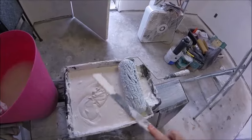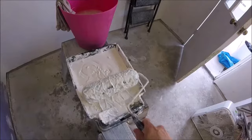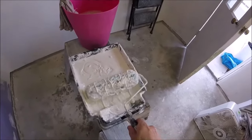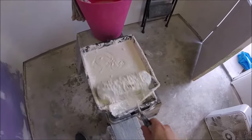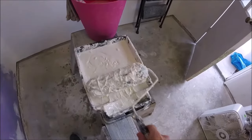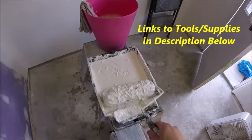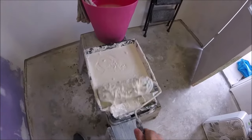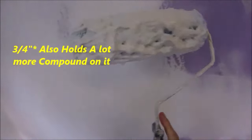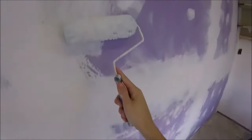I got it to the consistency I want. Now we're just going to take our normal paint roller. This is a three-quarter inch nap roller — you'll see it labeled for like a stucco masonry finish. You could use a half inch or three-eighths inch if you just want a dimple finish that won't knock down at all. But this three-quarter will give us a nice knockdown finish.